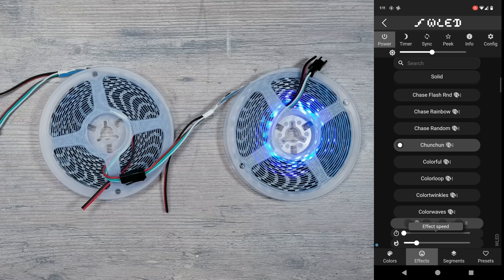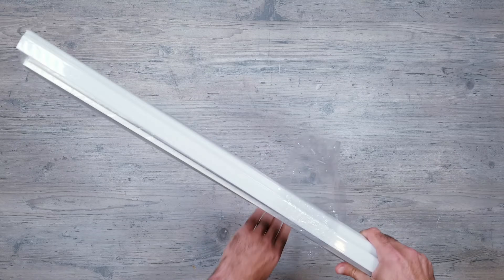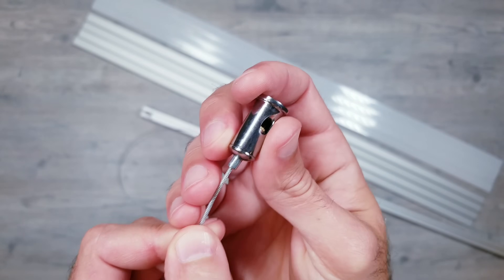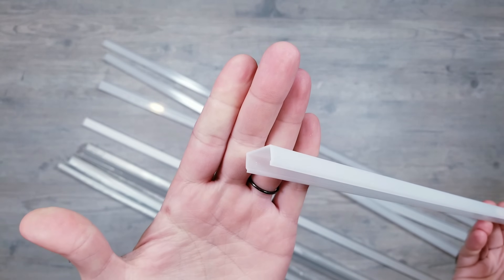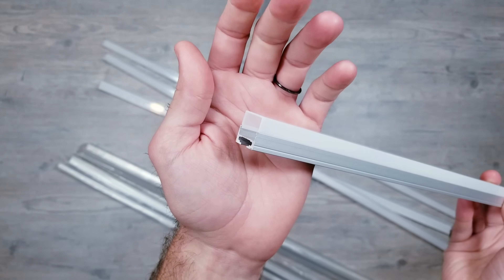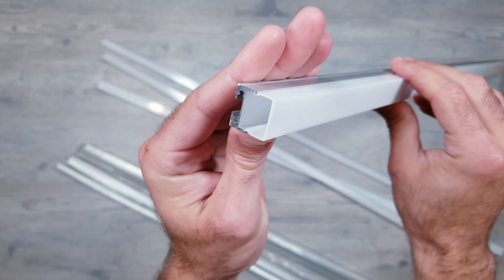There are a lot of reasons to get excited about these strips, but for me the biggest thing is the ability to try them on much lower profile diffuser channels where a strip with only 60 LEDs per meter would have very visible hotspots. Increasing pixel density to close to 100 opens up many more options. This is probably my overall favorite diffuser channel design — it has wall bracket mounting or a ceiling wire system, a flat top so angled corner cuts butt up perfectly, and the diffuser extends down each side casting light left and right. The bottom mounting track can also route power injection wires. The only reason I haven't used these channels before is that 60 LEDs per meter doesn't quite create a perfect neon glow, but paired with 96 LEDs per meter the results are very much perfect.